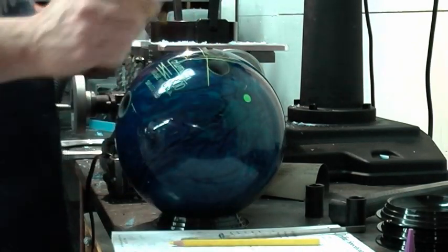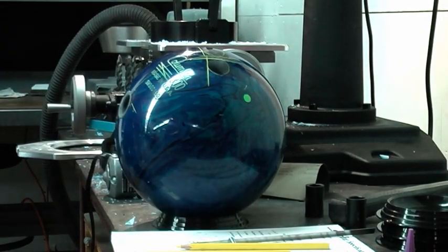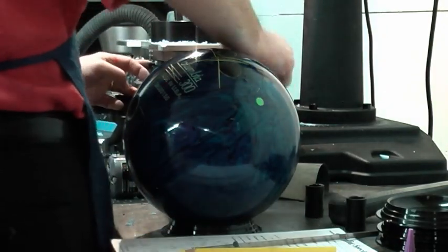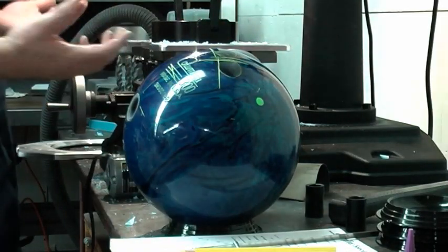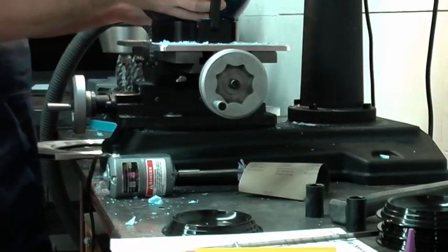Okay, so I'm going to drill the middle finger hole first. Our pitch is 3/8 left, 0 forward and reverse. So I'm going to crank the table. We go by the front scale here. There's a 1/4 and there's 3/8. Zero forward and reverse, we can leave that one. I've already installed my 31/32 drill bit.